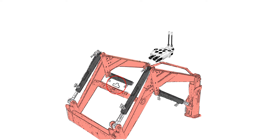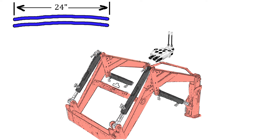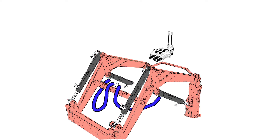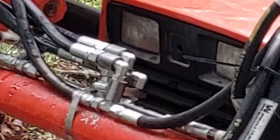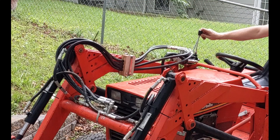In a center tapped scheme, a T is located in the center of the loader, and two identical hoses are run from that T out to each pair of cylinder ports. Then the center port of that T is connected back to the loader valve. This ensures an identical fluid path to both sides, which will result in identical oil pressure on both sides, and that should minimize, if not eliminate, the frame distortion problem. As you can see in the photo, there are four T's located in the middle of the loader's center support member, one T for each pair of cylinder ports, each back fed by a hose leading to the loader valve.